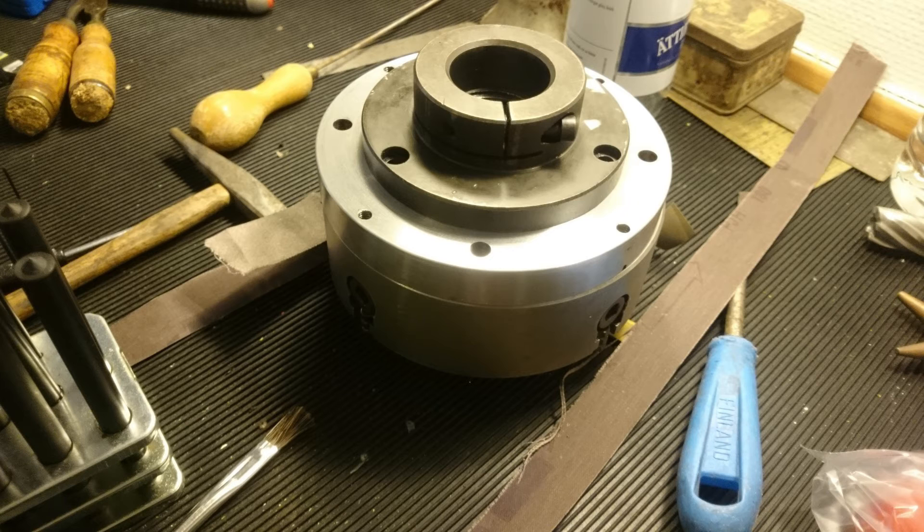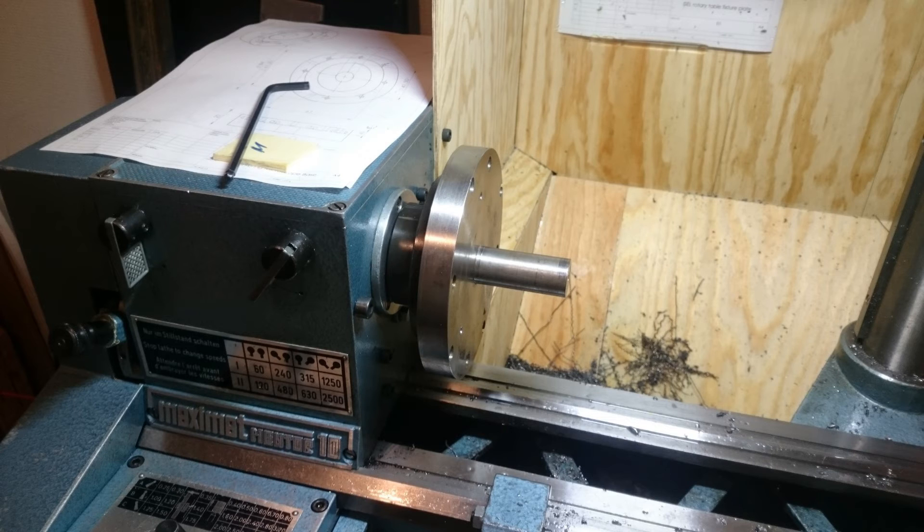After that I could mount the original adapter plate to the intermediate adapter plate. Then I mounted the assembly on the lathe and turned the side that would mate to the chuck. The DIN 55021 uses a short tapered nose with a taper of 7 degrees, 7 minutes and 30 seconds, which is 7.125 degrees. I turned a 3mm nose with the correct taper that the chuck registers on.